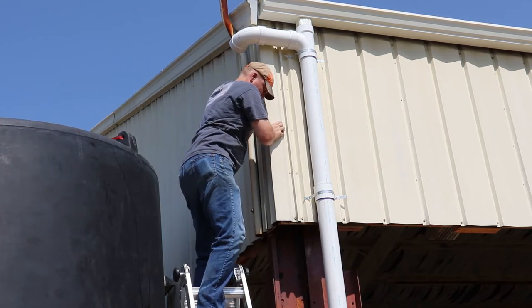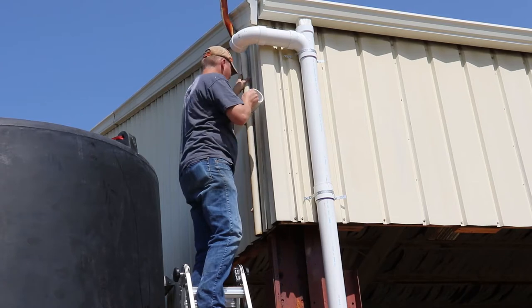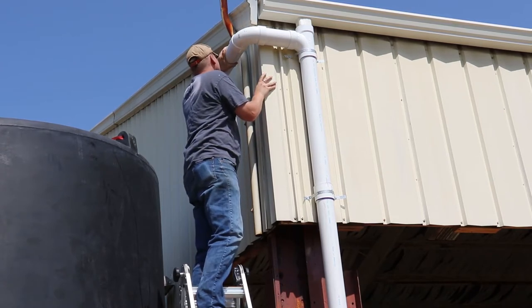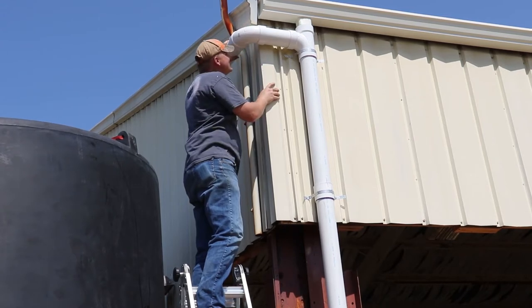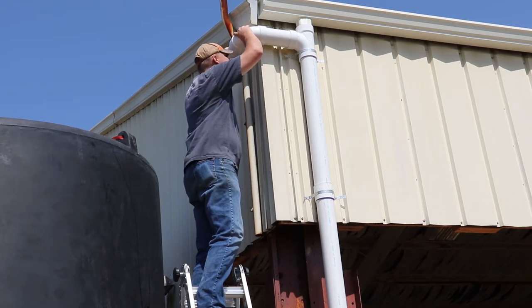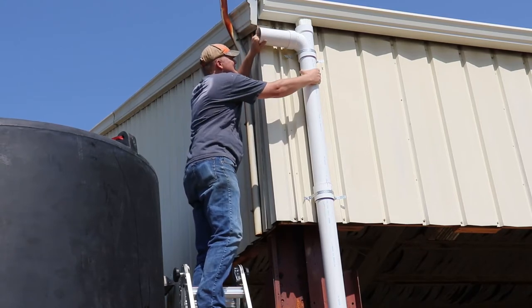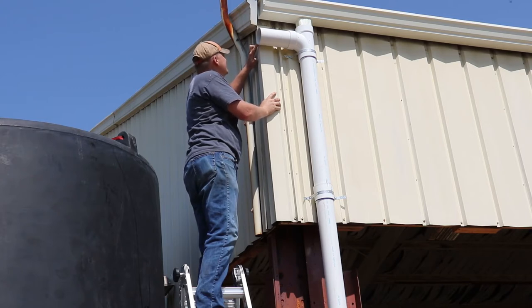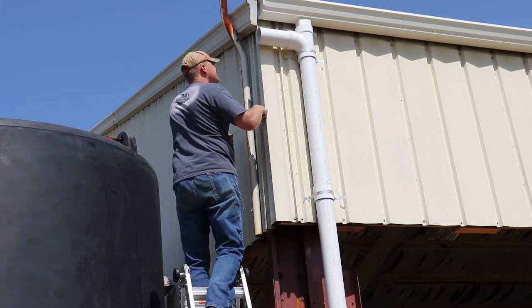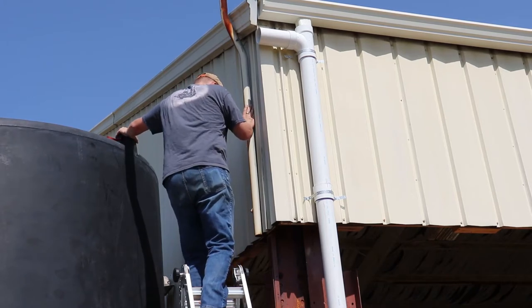What if while you're there, you just try and stick this in and check your distance off that other pipe? Coming up for the light. Look good? Maybe now's your chance to shorten up that pipe if you want. If it was me, I'd probably shorten it up. Well, it is you, so. And if I get too much shorter, he's going to start hitting here. Oh yeah, we really don't want that. Let's call it 64 inches to about the edge.